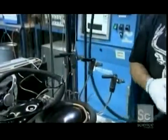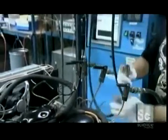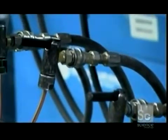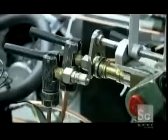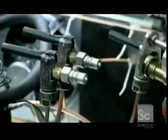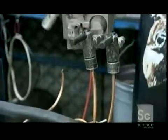Refrigeration occurs as cold gas in the evaporator coils pulls heat energy from inside the fridge. The compressor then changes the gas back to a liquid, while the radiator dissipates the collected heat. The expansion valve turns the liquid back into a cold gas, and the cycle repeats. With a charging gun, workers inject refrigerant gas into each tube, then weld the ends of the tubes shut.